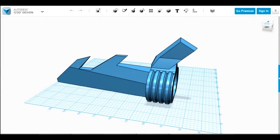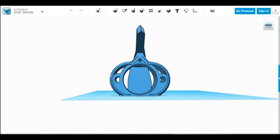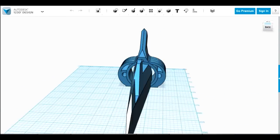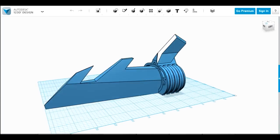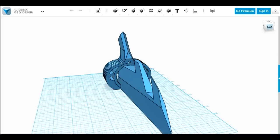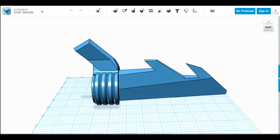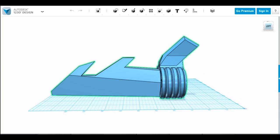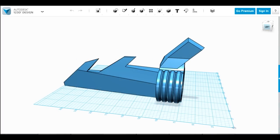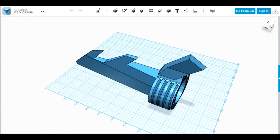A couple of days later, I'm just printing off the very last tail piece for the main section. I've had a go at designing the very tip of the tail — a similar section with two holes for the cord, but I've blocked up the holes in the bottom because this one is going to be printed as you see it rather than on its end. I want the extrusions to go the other way so it doesn't snap, and this is also going to be printed in NinjaFlex so I don't take someone's eye out. This quite big piece is going to be the very end of the tail, plugging in on the end with all the dagger sections facing the same way up the tail.